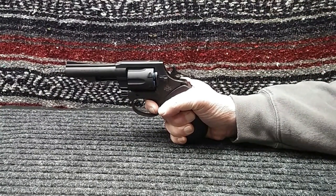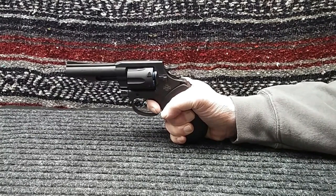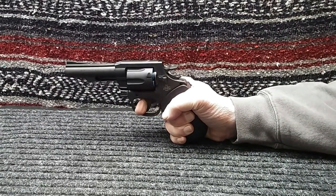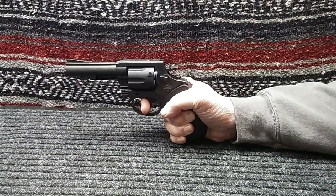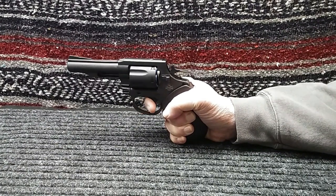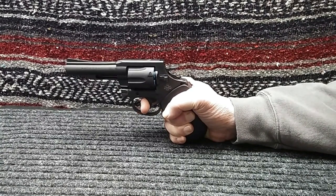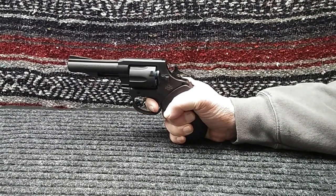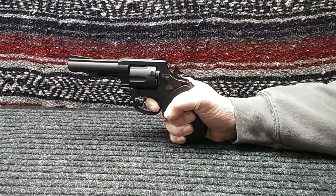Revolver timing. Now that is a real issue, or can be. As the hammer is forced to the rear, either through a pull of the trigger in double action mode, or by cocking the hammer in single action mode, a whole bunch of mechanical things have to happen to rotate the cylinder, align the chamber to the barrel, and lock things up when that happens. When the trigger is being pulled, or when the hammer is being cocked, a locking lug within the frame releases the cylinder, which allows it to turn. In the case of the RIA M200, cylinder rotation is to the right, like a Colt double-action revolver.